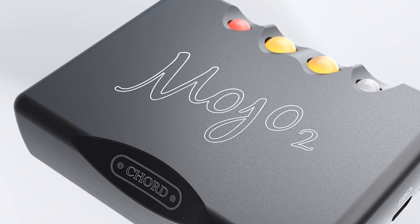What you've got with DSP is that as the signal gets smaller and smaller, the filter stops working because it cannot resolve the signal. So very, very small signals will have a different phase angle to very large signals. And this has now become one of my formal tests. If I put in a 0 dB signal, I measure the phase shift, I put in a minus 301 dB signal, and I again measure the phase shift. If there's a difference, we're in trouble. From listening tests, I know that if the difference is as much as 0.002 of a degree, you will still hear it, in terms of suppression of depth.